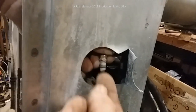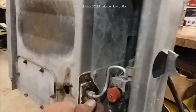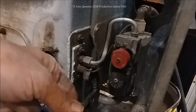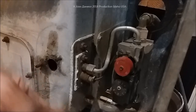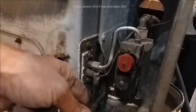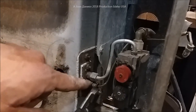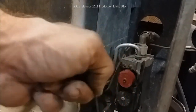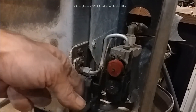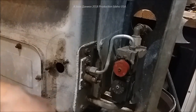You'll see that end there travels down and compresses it into place. Over here where this one is at, I'm just going to use a pair of channel lock pump pliers to get it freed up — it's an old one so I don't care. If you have to take some snips and cut it off right there to make it easier, do it — just don't damage your heater. Normally I'd use a wrench on this, and I know people are going to say use a wrench. I really don't think too much about a used part — don't save them.